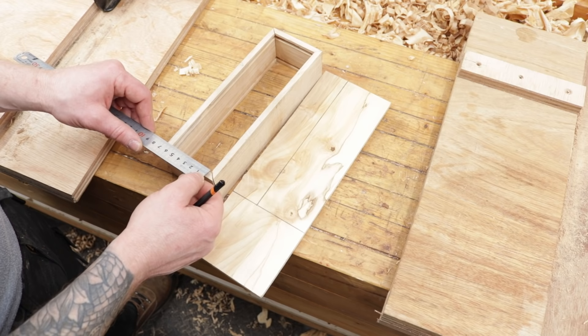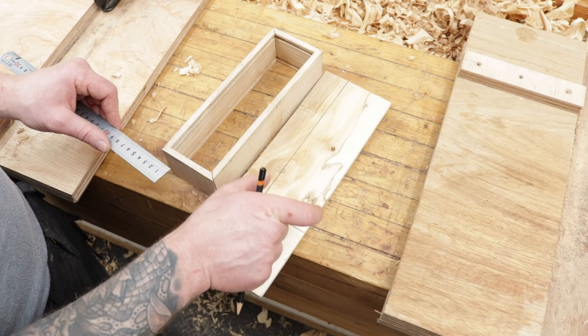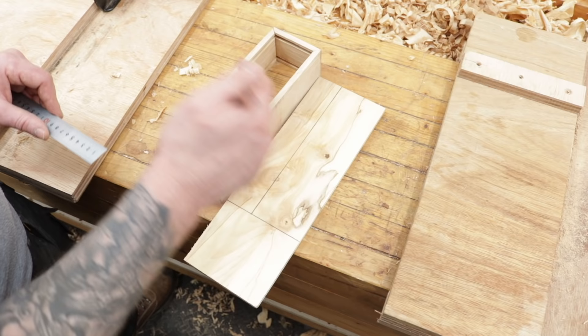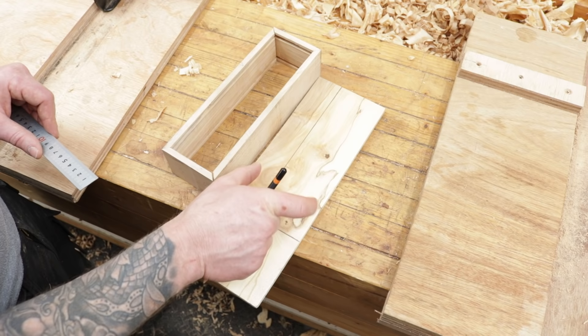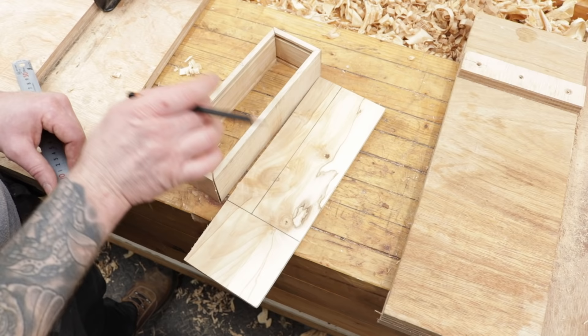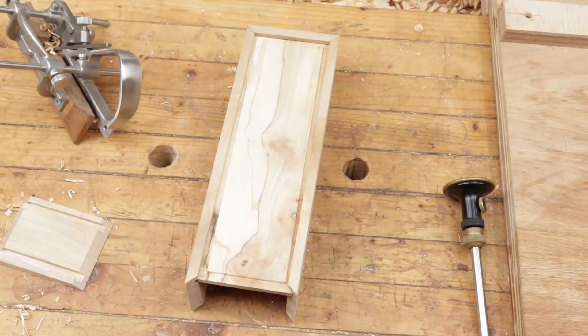The internal dimension of my box is 65 millimeters, plus I have a 4mm rebate either side — that's an extra 8mm, taking me to 73mm. I've measured the base at 70mm, so it's 3mm short, giving about 1.5mm either side — roughly 3mm total expansion allowance, which should be enough. We put a rebate all around the edge and slot it in. Wood is very stable along its length but not across its width, so we make the length exact but leave the width a couple of millimeters short to allow for expansion.